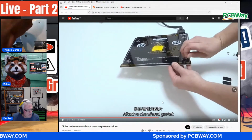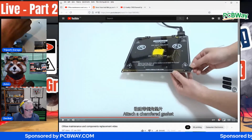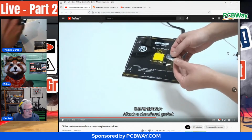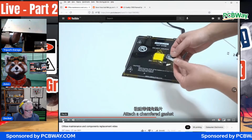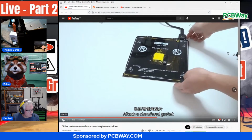video. What this maintenance kit comes with, supposedly, is 4 little plastic shims, and Kapton tape to put over the trace. So they put the Kapton tape on, and they've got these 4 shims, 2 for the front and 2 for the back, to put underneath your clamps. So even if you do rub through the Kapton tape, you've got a plastic shim now to isolate it.